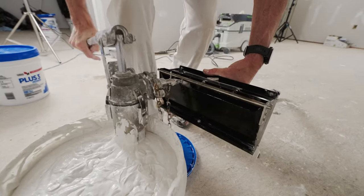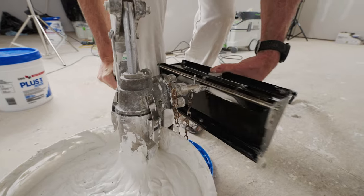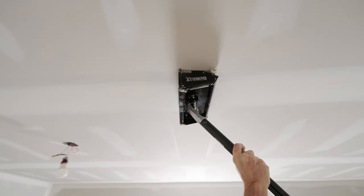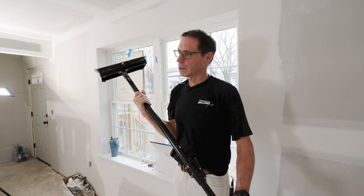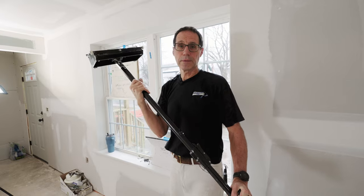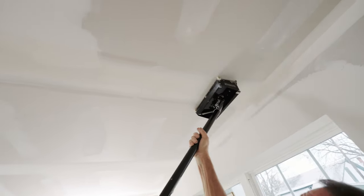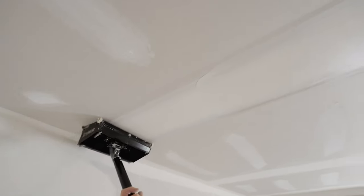This compound is a little bit thinner than what I used when putting my fill coat on, so I have to be a little more cautious about spilling it out. You can see it does take quite a bit of force to push it out, and I'm walking pretty much underneath the box as I'm going. If you find you're pushing really hard and your arm is killing you, it's probably because you have the mud too thick. I go over it twice, and I'm pretty happy with that. Now I'm going to do the butt seams.